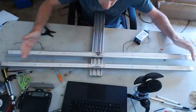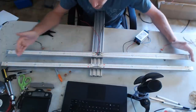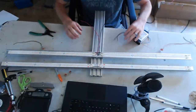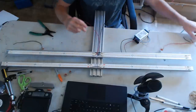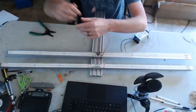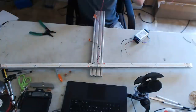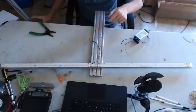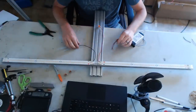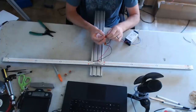Say we had 2 amps from the driver going to one 54-volt strip — that 2 amps divided by one is still 2 amps across the full boards. But now that we have two strip sets, the 2 amps gets split in parallel and runs as 1 amp across each board. Think of volts like hurdles: each volt is a hurdle the current has to get through. If it doesn't have the voltage, it won't light up — but the current can then be split.